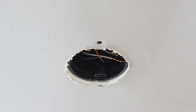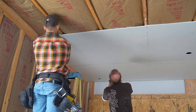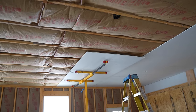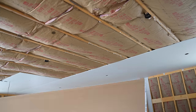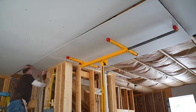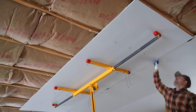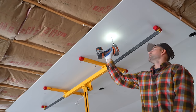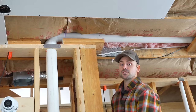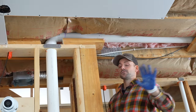After installing the full sheet, go back and install the cut piece to start the row — continue running to the wall, finishing all rows at once. One great technique is pre-starting screws on the ground before lifting the sheet into place, which requires less effort. To use a keyhole saw to cut around a wall, get a measurement and take a quarter inch off, transcribe measurements to the drywall, then use the chalk line for the top cut line.